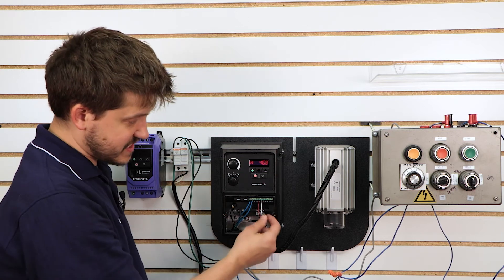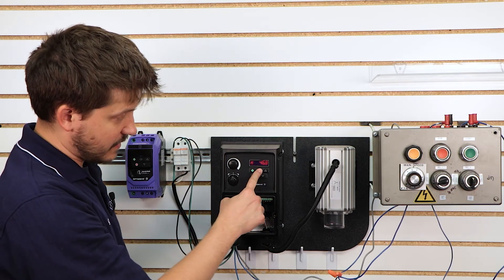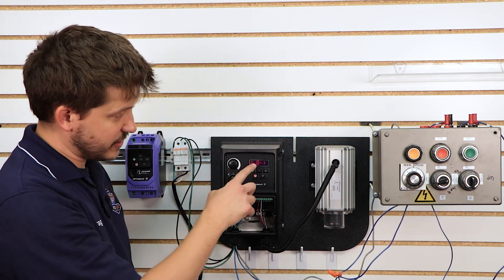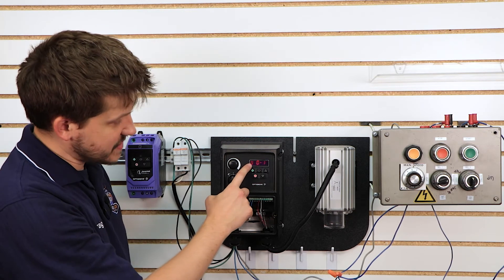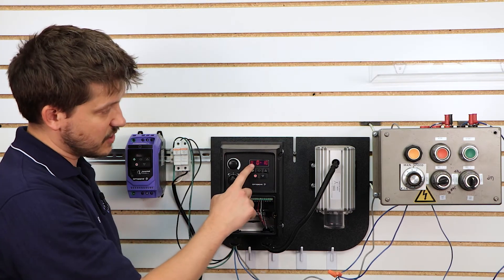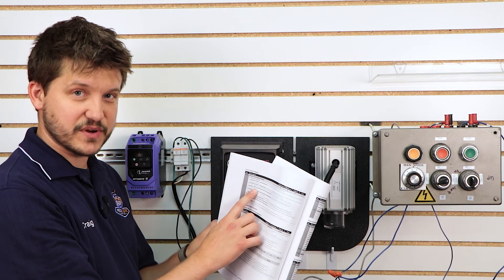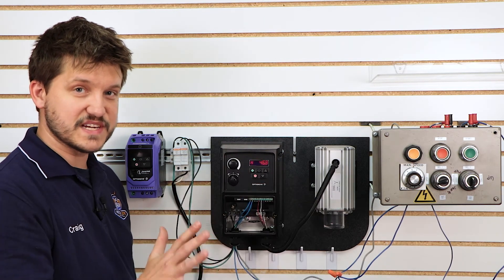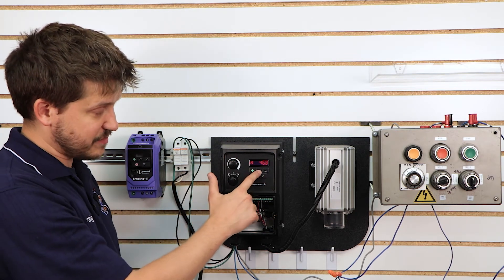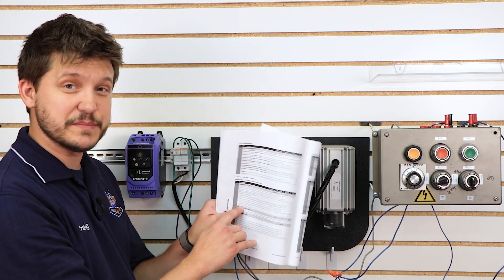If for any reason this particular speed reference is not responding, we're going to double check a parameter here — it's P16. This is your analog input setup. In our case, we're using a 0 to 10 volt signal, and so we set it to U0 to 10, which means unidirectional — one direction. So it's saying we're only going to go from 0 to 10 volts for our speed. You can check the manual for that parameter for different types of setup. Now, the reason I'm bringing this up is because if you shipped one of the ones with an integrated pot, the default for P16 is going to be 'in pot,' which is the integrated potentiometer, and it's down at the bottom of the list.